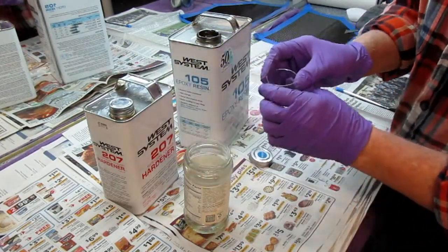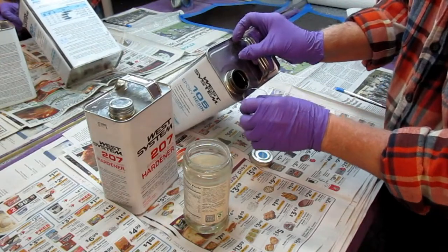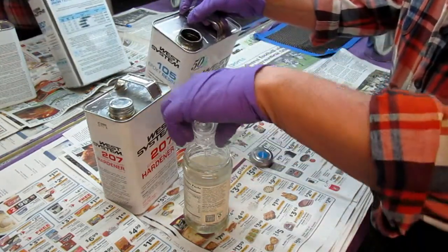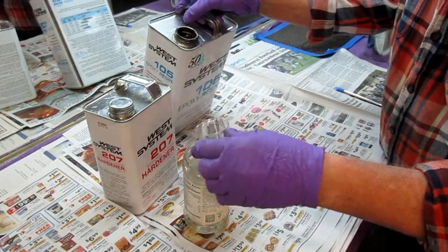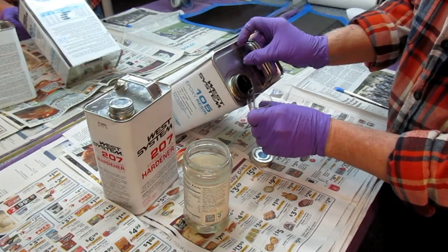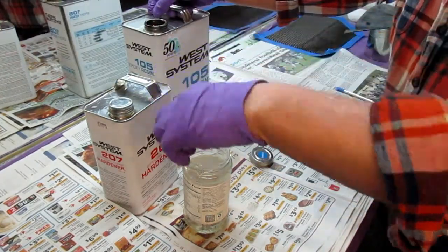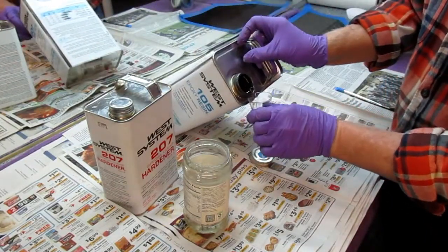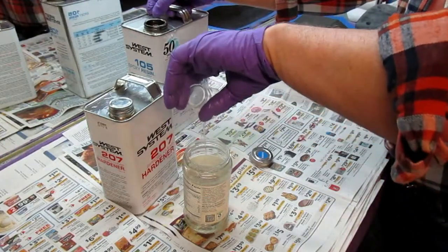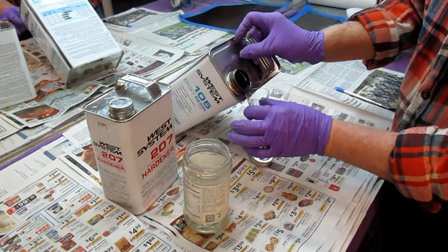I put an ink marker there where the amount that I think I'm going to need, it's 3.7 to 1. And again, this is not ultra critical. Any resin that's ultra critical, when they give it to you in little baby gram weights and half a percentage, it's a different thing. West resin is usually pretty friendly. And the nicest part about this whole resin system, there's really no stink at all. And that was the big selling feature for Karen.